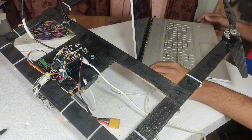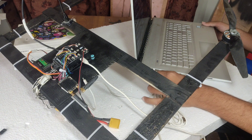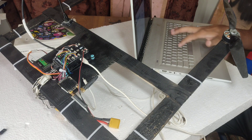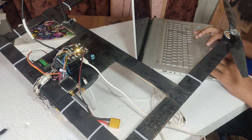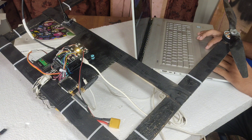Now it's time to program this drone. Programming is very simple — the same as programming a normal quadcopter drone. You can see the programming video from the top card. The thing that is different for this drone is that I've also introduced a servo, so I need to set the servo in programming. I will show you how to set the servo to your RC channel.